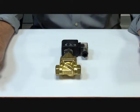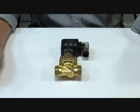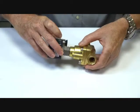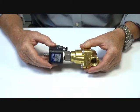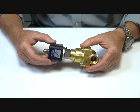They are available from 1.5 inch BSP to 2 inch BSP. They require a minimum differential of 0.5 bar and up to a 10 bar pressure range. They have a brass body with 316 trim and stainless steel PTFE seats.